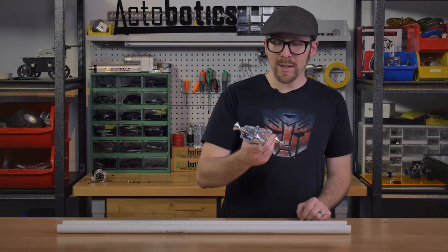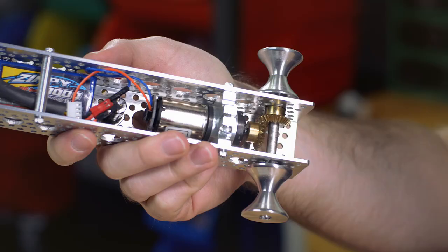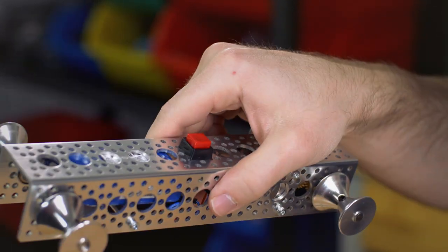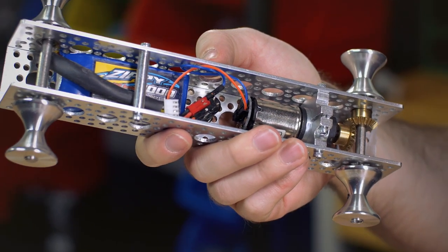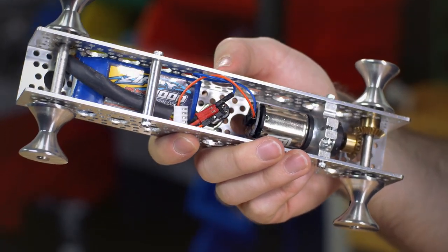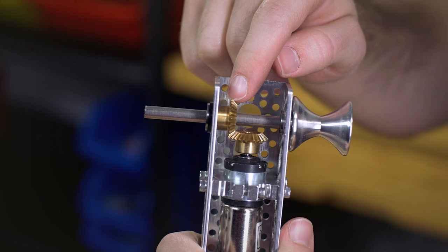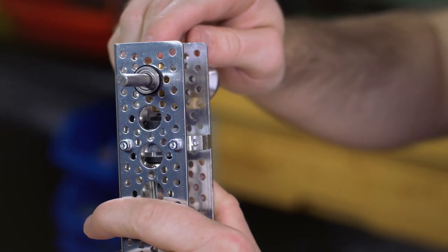In this first example, I'm using a planetary gear motor, running some bevel gears here to drive the back shaft. It's held in place by a 22-millimeter clamping hub, and powered by a lipo battery with a JST connection. I'm using a latching push button to turn it on and off. To make plugging things in easier, I've simply soldered a male header pin to the bottom of the push button so I can plug in my jumper wires and battery connection easily. Since the spacing is crucial in this setup, I've had to space out the bearing just a little bit by using a 3/8-inch shaft spacer to make room for this bevel gear.